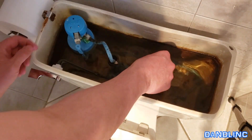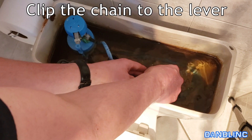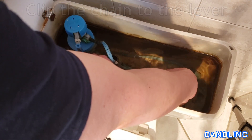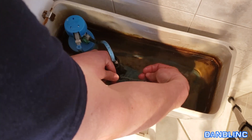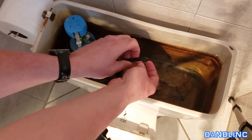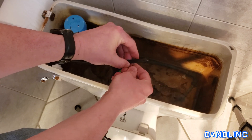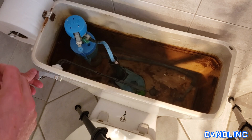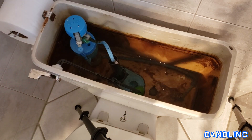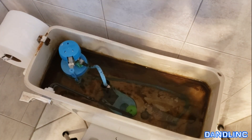I'm going to reach in and grab it — that is ice cold water. Pull it up. This chain piece is also adjustable. I'm going to see if I can get it on there. I'll just put this paper clip like hook on the arm. It flushed again — just going to put this paper clip hook on the switch on the arm. We'll let it fill up. Once you clip that chain — that little paper clip — onto the arm, you're essentially done.